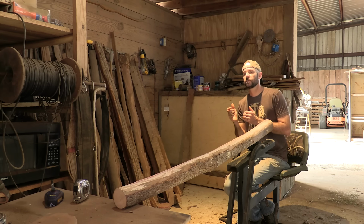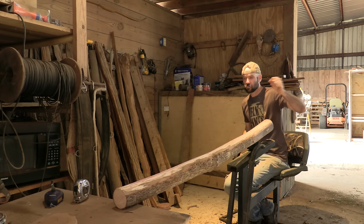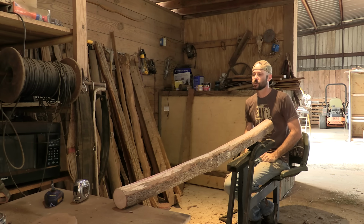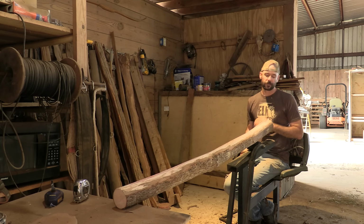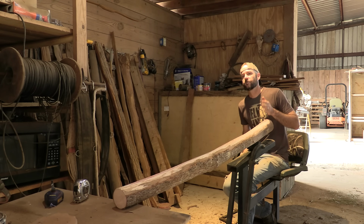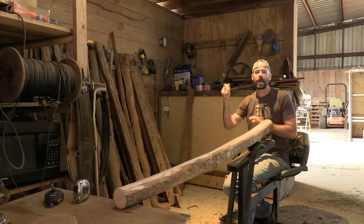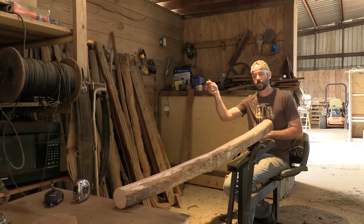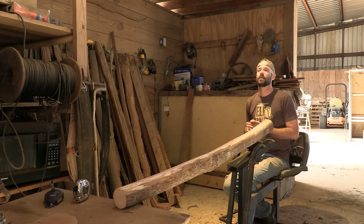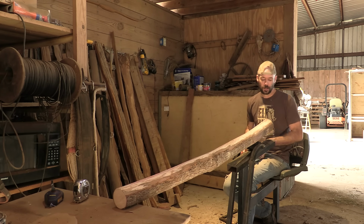When people shoot self bows that are poorly made, they have what's called a lot of hand shock, so when you shoot that bow, it'll rattle in your hands, and it's just uncomfortable to shoot. They're sluggish, they're inefficient, they're not very fun to shoot at all. That hand shock comes from energy that's left over in the bow, and a lot of that energy is because there's just a bunch of mass in the limb tips. So anything that you can do to reduce mass in the limb tips will go a long way in making this bow much funner to shoot, much more efficient, much sweeter.